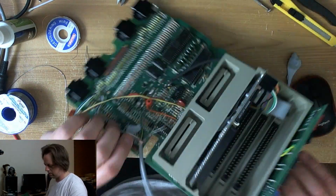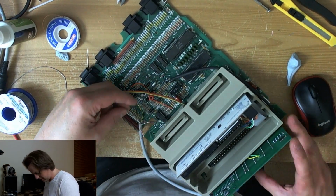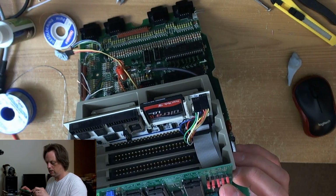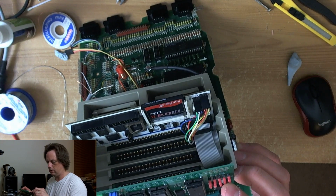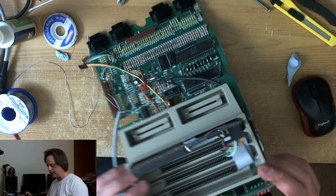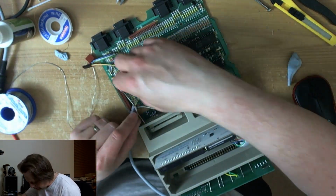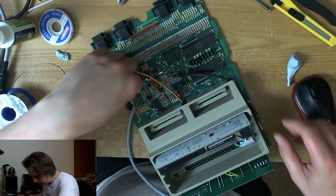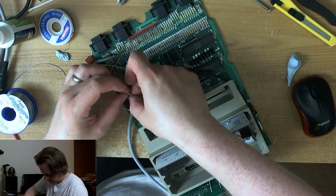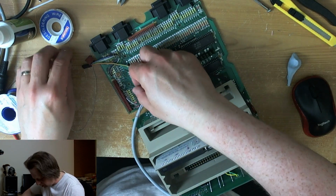It's done. Next, two more wires before we should be able to get a picture of this thing. Grey is ground, so we ignore that. Audio is green. Now audio goes at the front, so white must be luma, and luma goes in the middle. If all my calculations are correct, which they're almost certainly not.